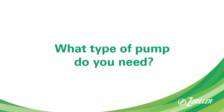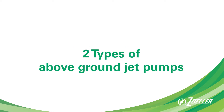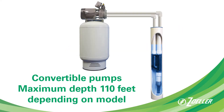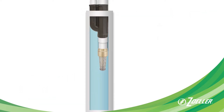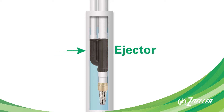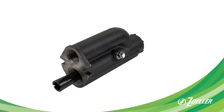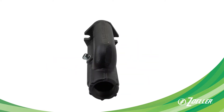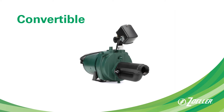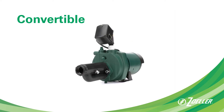So how do you identify what pump you need? There are two types of above-ground pumps. Shallow well jet pumps pull water from a maximum depth of 25 feet. Convertible jet pumps are normally used for deep wells up to 110 feet for some models — for deep well applications the pump needs an ejector installed in the well. A convertible pump can also be used for shallow wells up to 25 feet when the ejector is installed on the pump.